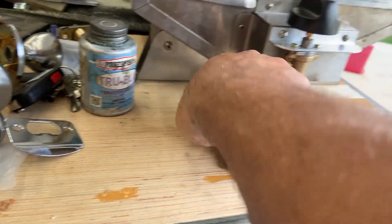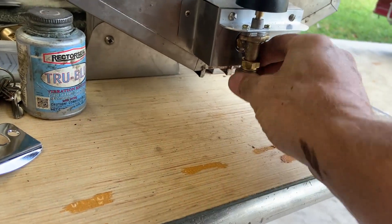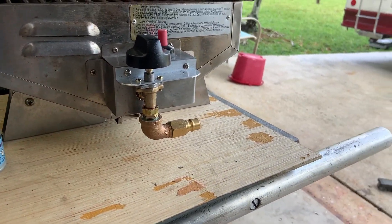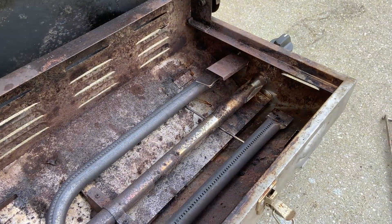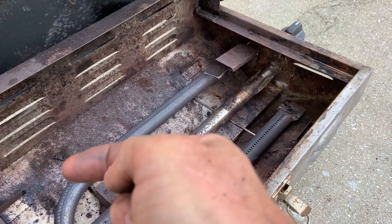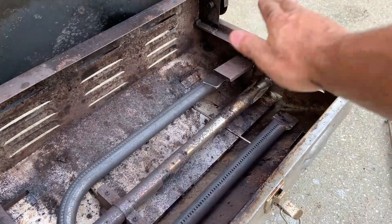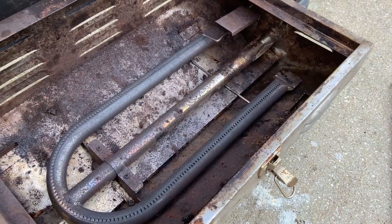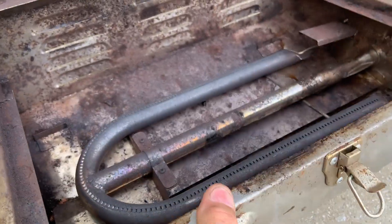That's done. I'm going to have to check it to see if it works — it's pretty rigid, kind of hanging in there on everything, and the knob works just like you'd want it to. The igniter still works. I gassed up the propane tank today, so theoretically this thing should work. Well, it works — it's on, but we're not getting much flow. I don't know if we've got a pressure regulator problem or maybe that jet is just not big enough. I mean, it's on, but I would like it to be a lot hotter than that. I would like a little bit more flame. I know it's on because it's freaking hot as hell — it's like it's on low.